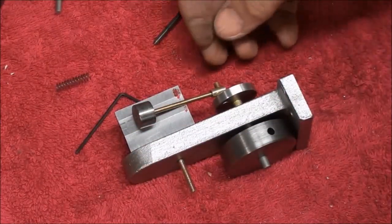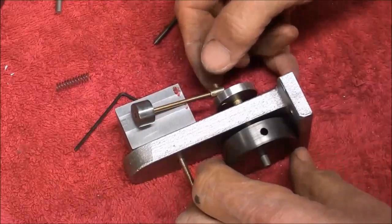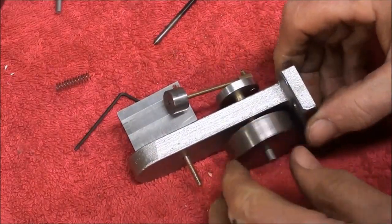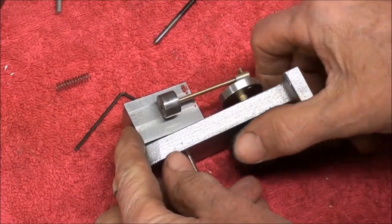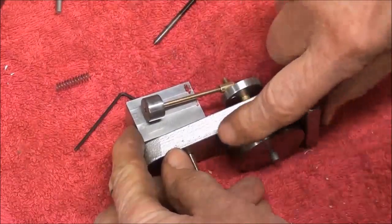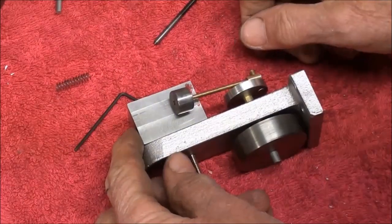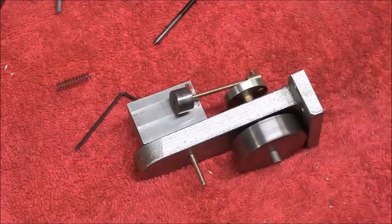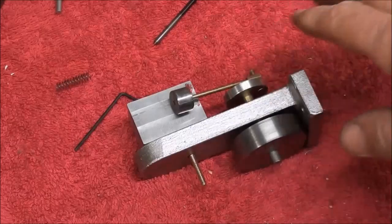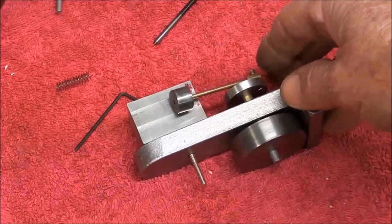What I'm doing now is trying to determine the length of the connecting rod. The piston is still on there loose. As I rotate the flywheel I can see pretty much where the stroke is — right now it's coming up too high and not coming down far enough. So I'm going to shorten this up by about 3/16ths of an inch, then try it again, and then I will put the Loctite on off camera. I'm fitting it up by eye rather than to a dimension.